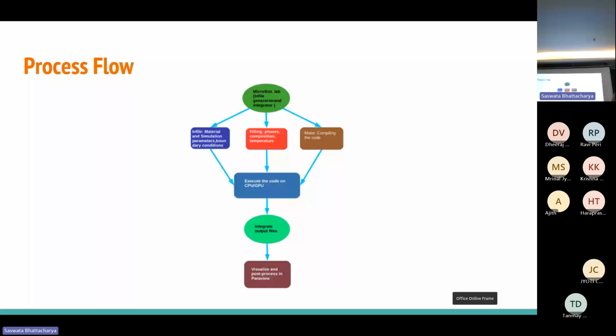You will think that this solver will solve better than that solver. That would mean physics is coming differently for this solver. No, this is not so, because inherently the physics that you put in comes through your boundary conditions, initial conditions, and the model. And the model is very, very similar for our case. So please do this whenever you do solidification or precipitation or any such complex problem. Remember to use one or two solvers and see whether they converge.